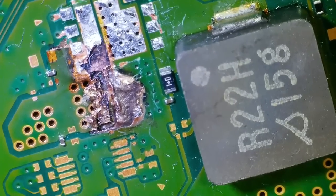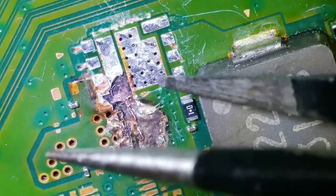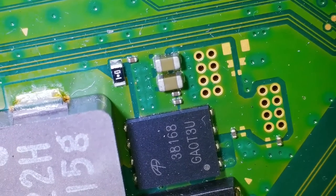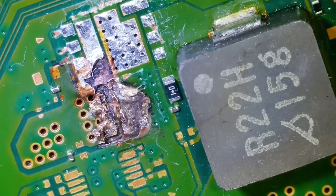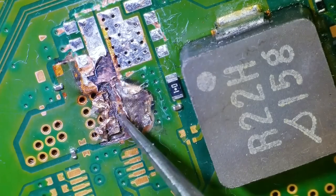The middle section travels down traces. So where would this middle section travel to, I wonder? One second. Travels down traces there. See, I can't even test which is ground because everything's shorted at the moment. Well, this must be connected through to here. So what I'm wondering, has this layer shorted with this layer here?